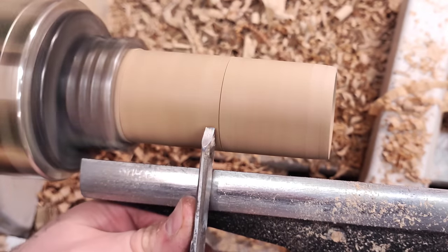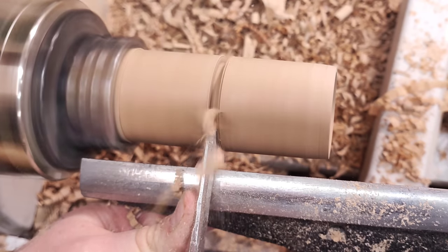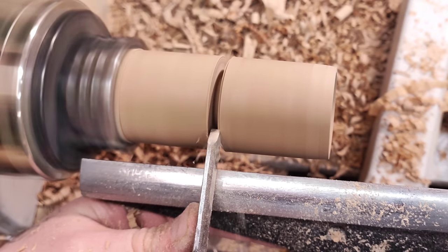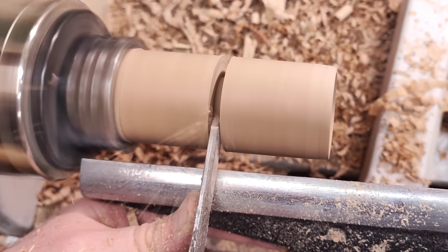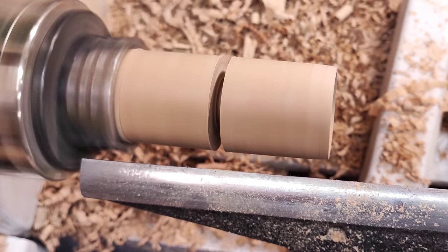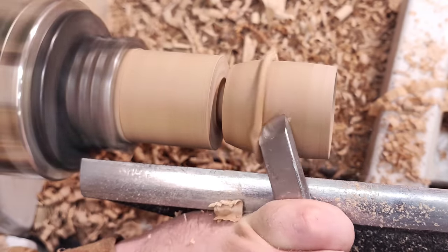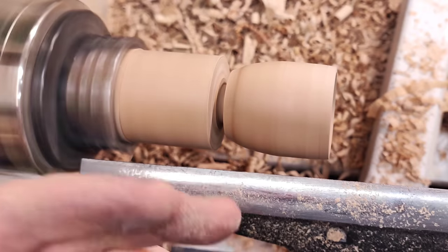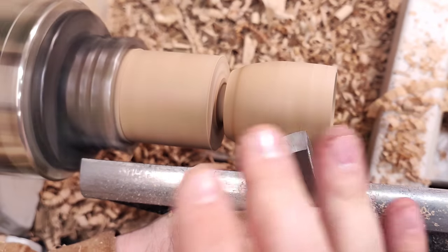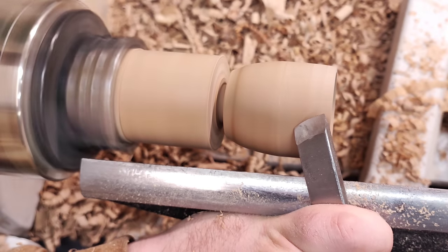I have a set length and I use a parting tool, going around one millimetre off the line, then on the line, and split it in half. I go around one third of the diameter here. Now with a smaller skew I can shape the profile — I don't use any templates; I tend to visualize what I'm doing. It may not be the perfect outside shape on all of them, but it's pretty close, and the more you do this the better you get.